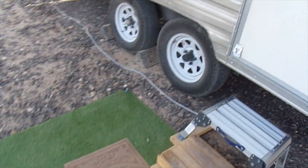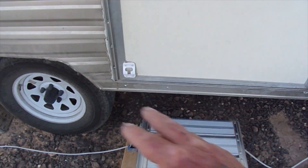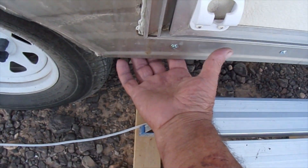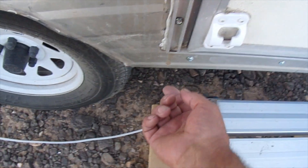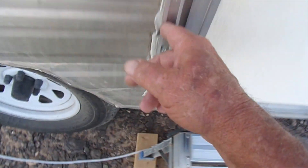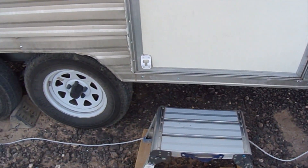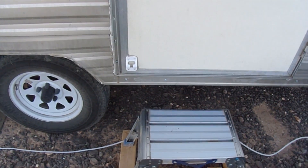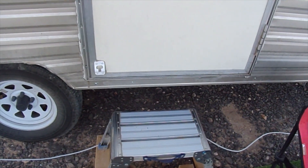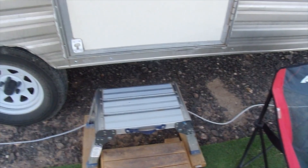I may get a piece of metal, put it over the gap and call it good. I'm getting really frustrated with it, but right now everything is safe. I pulled the door out and replaced all of that. There's a brace here for the steps but it also has a carriage bolt that comes down through the top, and unfortunately the wall stud that goes all the way up is on top of that carriage bolt. So instead of removing the wood, I put a lag bolt in from the bottom — about three-and-a-half inches long — drilled the whole underside, used a lock washer, and put some Loctite on it.